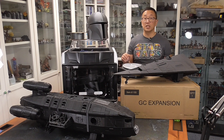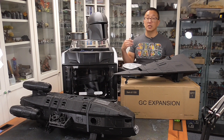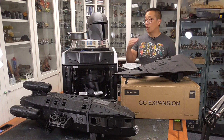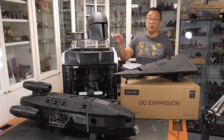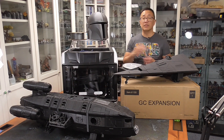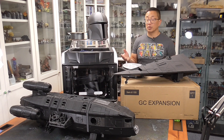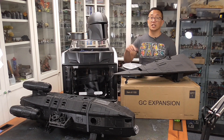This machine was pretty easy to set up, but it had a couple more steps than the Bambu — I did do the paper test with the first leveling, and I only had to do that once. Once I was able to do the paper test where it catches a little bit on the nozzle, it went through the whole process of leveling the rest of the bed. With the Bambu, there is no paper test. So it does add one step in terms of bed leveling. But since doing that initial leveling, I haven't had to re-level since, as it goes through all of those tests before each print, just like the Bambu.